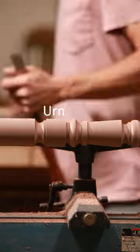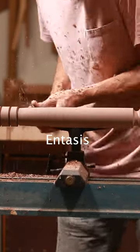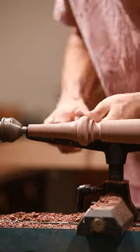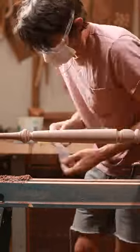This is an urn. On the original, the taper isn't straight but slightly curved like the entasis of a column. The three-quarter inch tenon at the top needs to be the most precise diameter on this turning because it needs to fit snugly into a three-quarter inch hole. I leave it slightly oversized so there's material left to sand away.